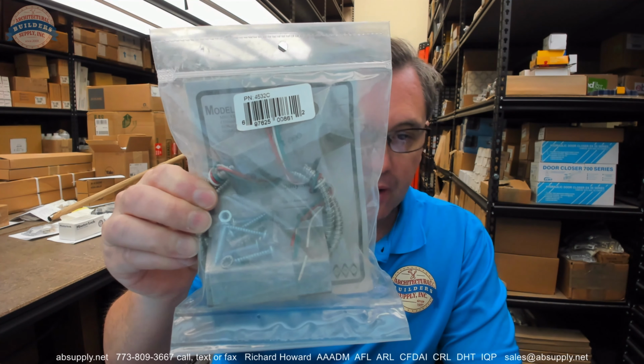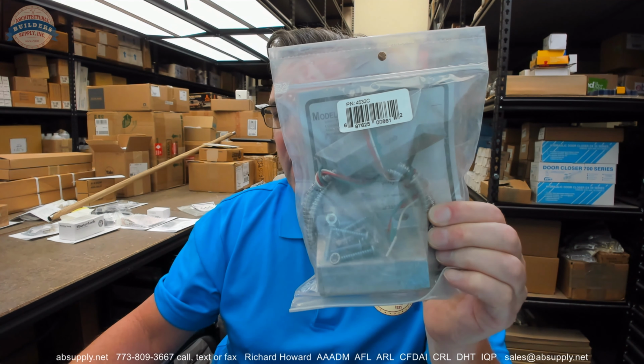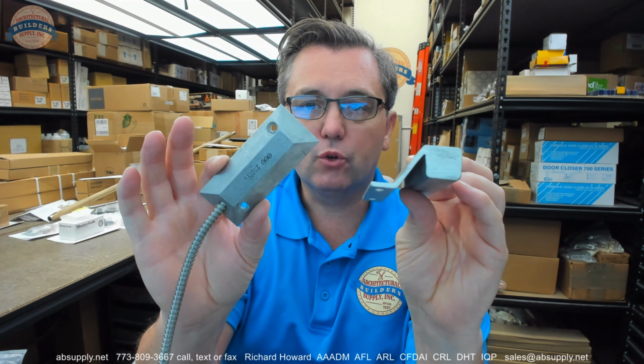This video is to bring you a closer look at the GRI 4532C. This is a miniature low-profile reed switch, which is set in cast aluminum, which makes it durable for environments that would be subject to traffic, foot traffic really. People coming in contact with it, moving parts, I'm thinking an overhead door, things of that nature.